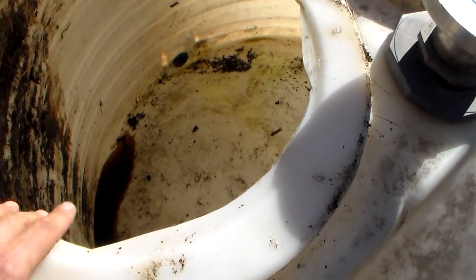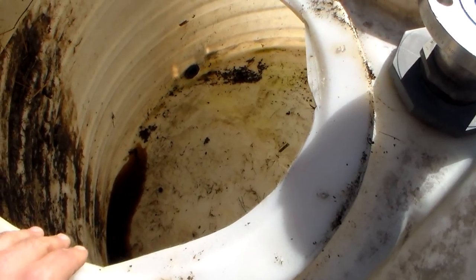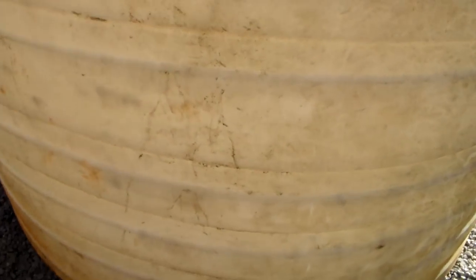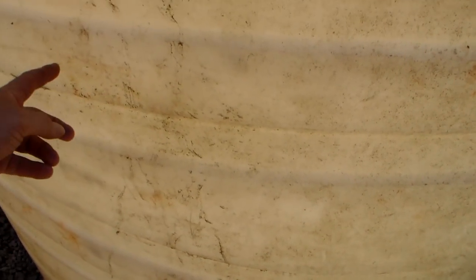I could enter through the top opening — that'd be fine for storage or a cache where you're not getting in and out frequently. But I'm truly thinking about cutting a door. I've cut tons of metal. You cut this side first, put your hinges on, bolt the hinges on, and then finish cutting the rest. The door becomes a perfect fit. You can bolt a doorstop on it.